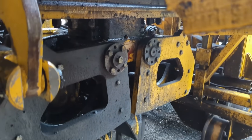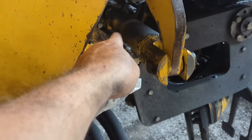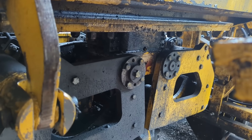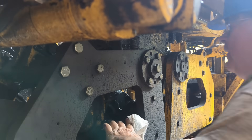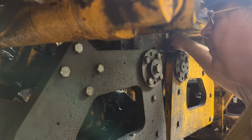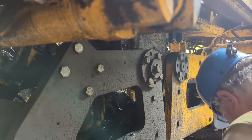Before, I used to have to crawl back in there and get the insides of both work heads — this work head and the one over there. Now I only have to crawl here and get to the blocks, so it's a whole lot better. I clean those fittings off first. These also grease the bushings on the squeeze cylinders — makes it nice.